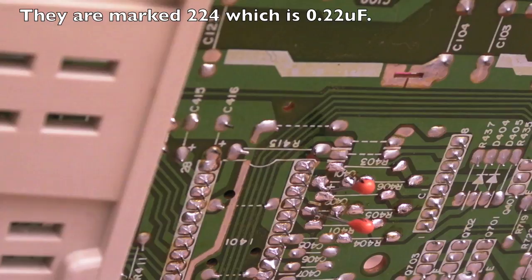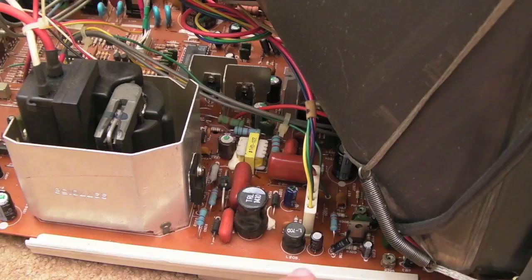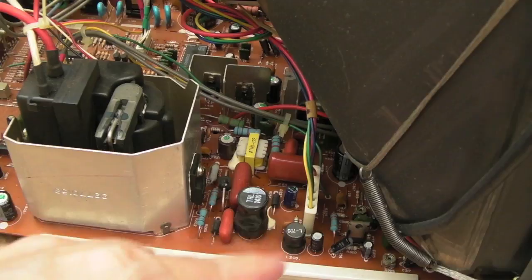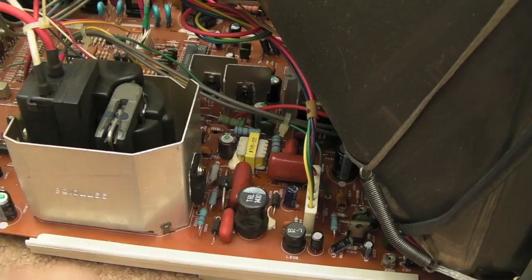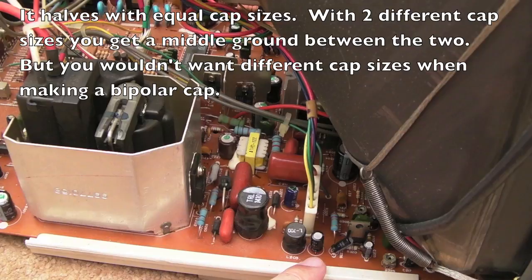Since the bipolar cap was alright, I've swapped it back - I've put the original bipolar one in there. I'd prefer to have an actual bipolar cap in there than the two caps I had previously. The way I did that is just join the negatives together, and then the two positives on the outsides just go into the connections. You've also got to double the size of the caps there. I used 10 microfarad caps - two 10s - and it halves, you end up with five, which is as near as dammit I can get to 4.7. So we've put the original 4.7 in there.